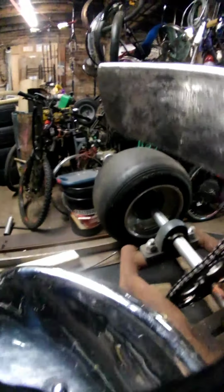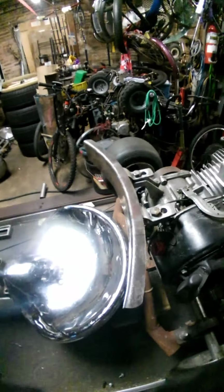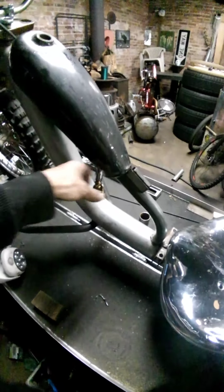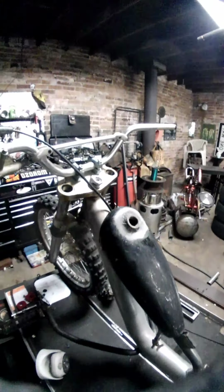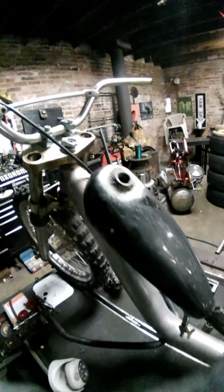Just wanted to give a little looky-loo for the copycats. Maybe somebody give them an idea. I was gonna cut those tabs off of the block, but I decided to put a little back piece on there. This brass here is just set up so I had something that I could tighten the water with when I flush the tank out, make sure it's all right. Just a little sloppy weld with a flux core MIG and the tank burning through.